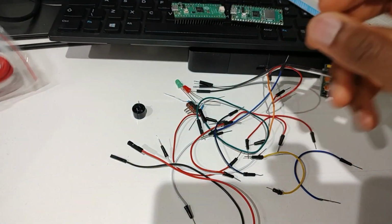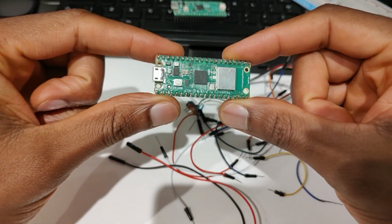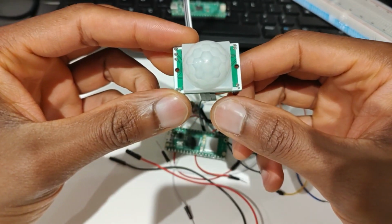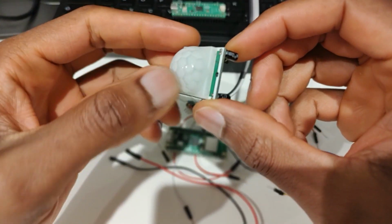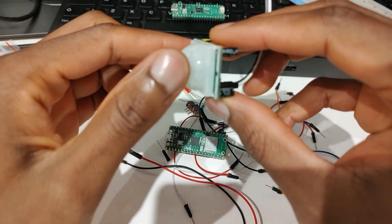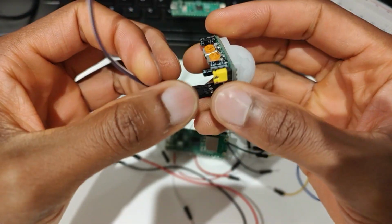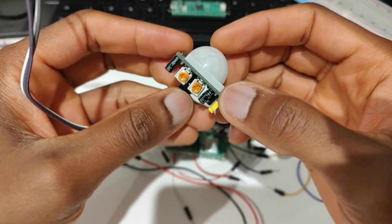So again, the way this system should work, the Raspberry Pi Pico W is going to have the program on there. I forgot to show my motion sensor. Here we go. This is a PIR, a motion sensor. Very simple, very cheap, less than £2, I think. You can pop the lid off this to make it more sensitive, because this does just hide it and protect the sensor underneath. This is what it looks like. I've got 3 cables coming out, and I've got 2 potentiometers here, 2 variable things I can change.